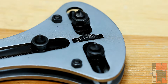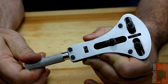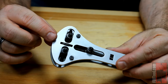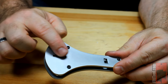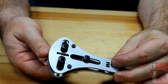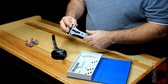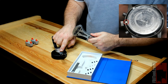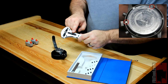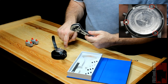Now I've got my three pins in place and they're all held in by friction. They're adjusted by turning either the handle, which moves the single pin on the bottom backwards or forwards, or the two pins on the top, which are moved by a thumb screw that protrudes from the back. By rotating the thumb screw they move out or inward. You're going to line these pins up on three of the notches on the back of your watch — two pins on one side and one on the other, skipping a notch in between, like a triangle.